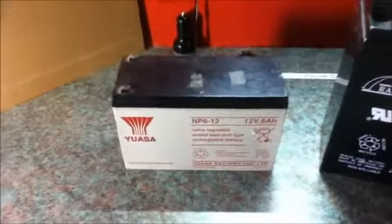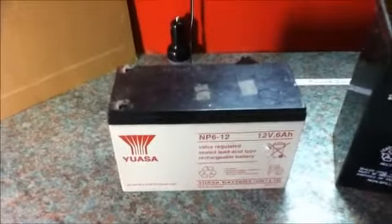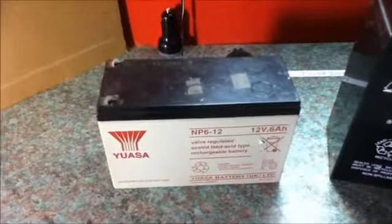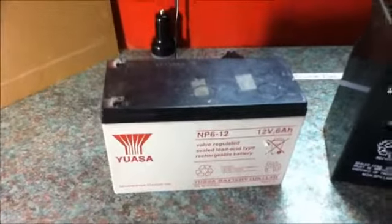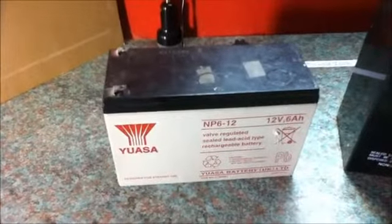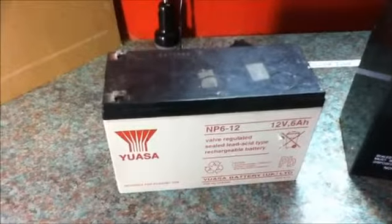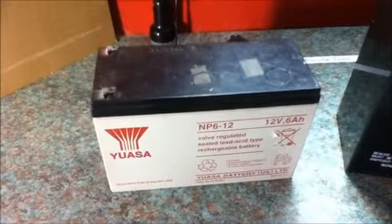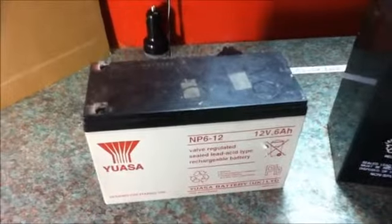We are doing a DIY system, so we would normally use 12 volt batteries, but there comes a limit to the size of 12 volt batteries that you can buy. At that point it might be easier to buy two 6 volt batteries and wire those in series, since they make larger capacity 6 volt batteries. And if that is not big enough, you can buy individual 2 volt batteries and wire those in series to get 12 volts.